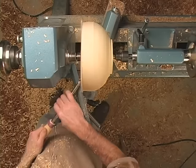The tung and the linseed oils, when they're mixed with these accelerators to make them dry, make them very toxic, so we have to be very careful not to breathe or touch them while we work with them, similar to all these other products. They're perfectly safe when they dry to the end user, but as craftspeople, we really have to take care that we don't make contact with these finishes.